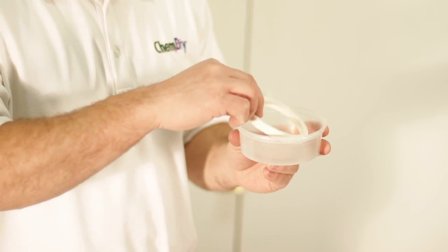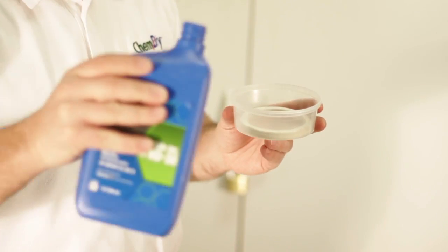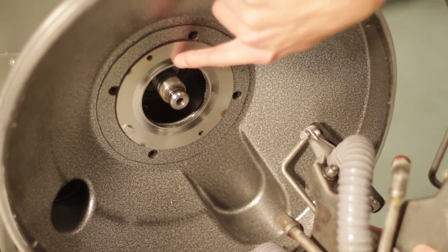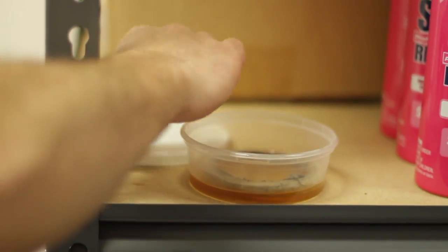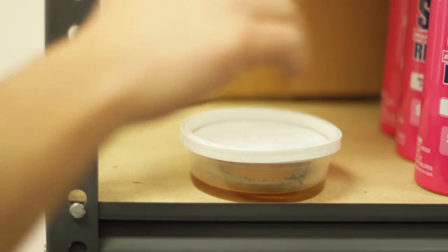You'll also receive a felt gasket with your shipment. Place the felt gasket in regular 30-weight motor oil overnight to allow it to soak up the oil. The lubricated gasket allows the cleaning head to spin against the bottom of the bell housing while still maintaining suction. The felt gasket should be removed at the end of every day and allowed to soak in 30-weight motor oil overnight to prepare it for the next day.